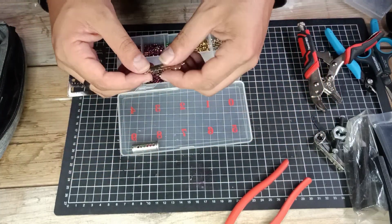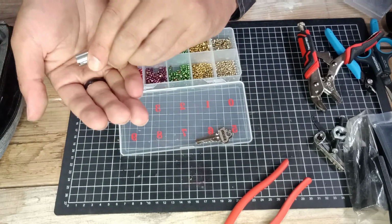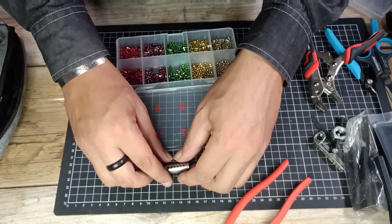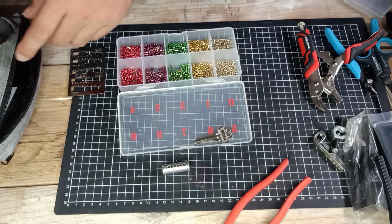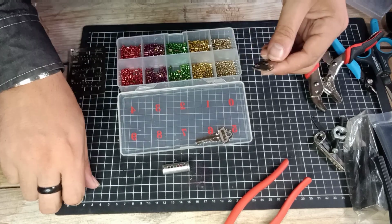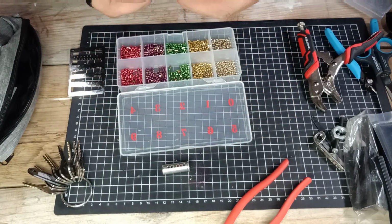So what I'm going to do is actually change that now from a 2. This is why you double check your work. So I'm going to change that from a 2. I'll try and go the maximum I can. I like to stay right on the edge of the max cuts. I'll drop it down to a 3. Yeah, I like to go right on the edge just because it makes a more secure key, in my opinion. Better bitting, high cut right at the back.